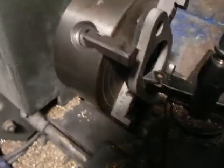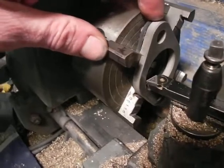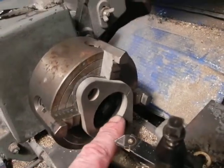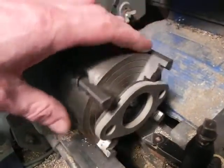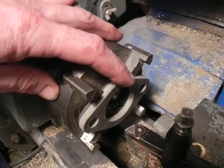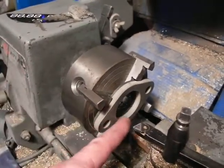We're opening up a 1.5 GP steel spacer flange for manifold fabrication, and we're using a 1/16th carbon fiber gasket at back so that we don't come too close to the inner edge and hit the chuck — we'll hit the gasket before we hit the chuck. This is chucked on a four-jaw chuck and centered. We're going to spin this up and open it to fit a JEGS 1.5 basic U-bend, so that we have a manifold that comes out this direction with a straight spigot for good flow direction and a line of sight from the carb jet to the opening.